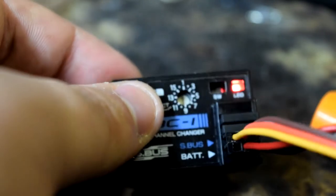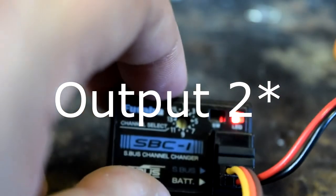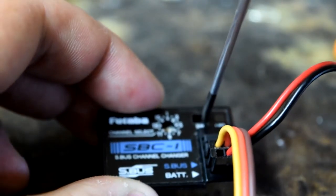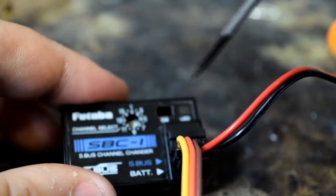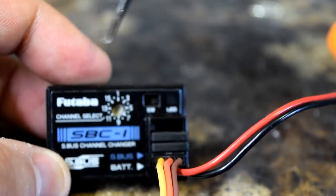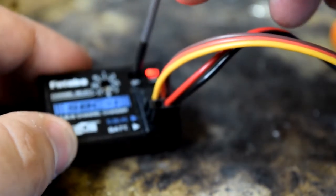Then we remove the power and plug it back in. We go to this little doohickey and move it to channel two by pressing the button, then spin the rotary dial to two and press the button — done. Unplug, plug it in again. We're going to press that button to get to three, then rotate that by one click to three. Just to reaffirm: this is your transmitter channel, so for example aileron is one, and on here you're changing which output you want it on. Three is three — press the button.